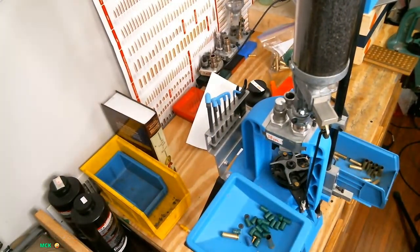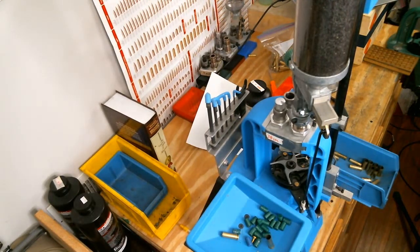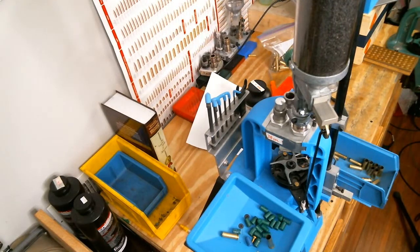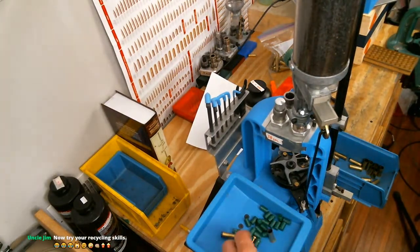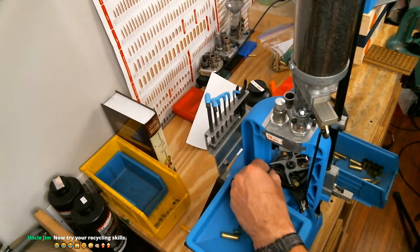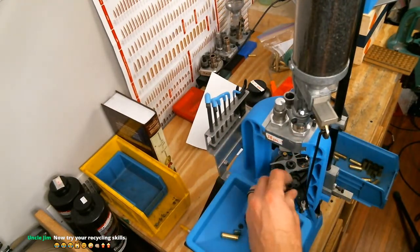All right. That was easy. Nickel brass. Boom. Total loss. Yeah. Oh well. I'll live. Okay. We're now regrouped. We're going to put the seating pin back. This one has a primer, so we'll go to stage 2 to throw some powder.